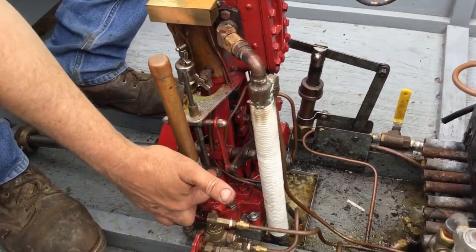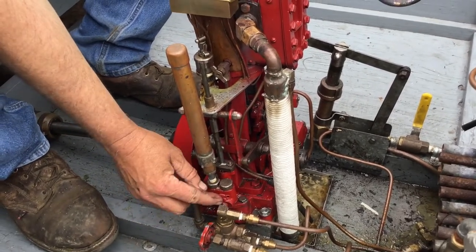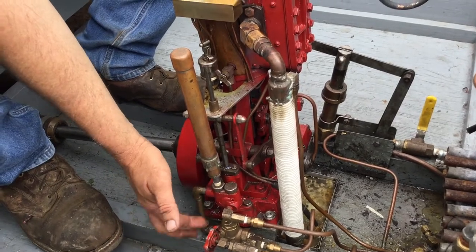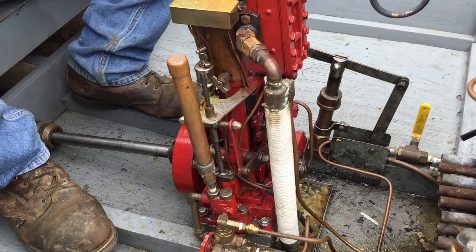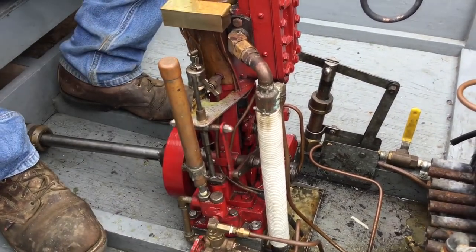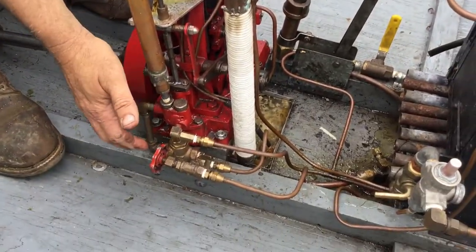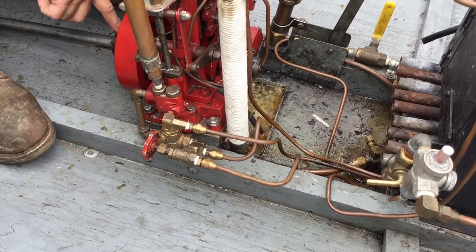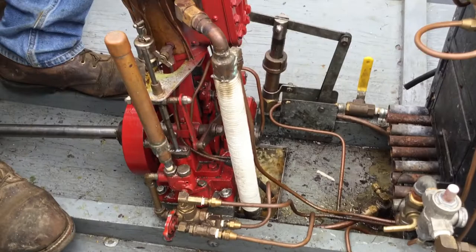This is your water pump. The packing's probably going to need replacement. Now the casting is a bit delicate — you can see there are some threads where someone busted it a little bit. When you ever have to do maintenance and take the engine out, just be careful of the assembly. When you bench it, put on a couple of two-by-four blocks because the pump is lower than the frame. All there is are two Allen bolts on the shaft — just take these three bolts out and slide it forward.